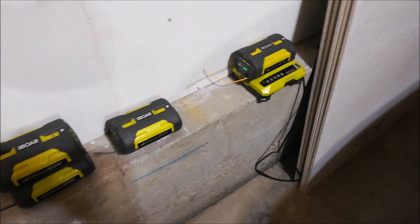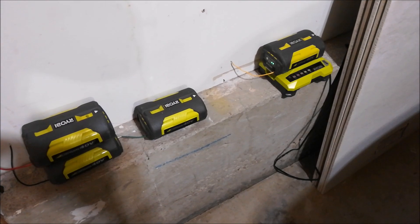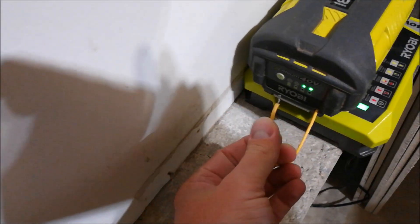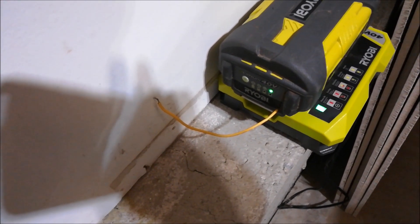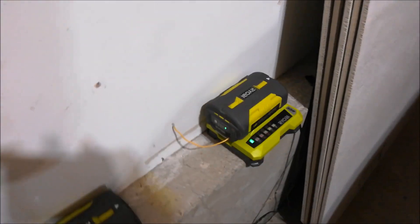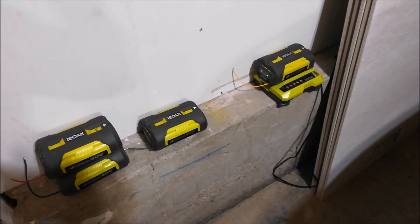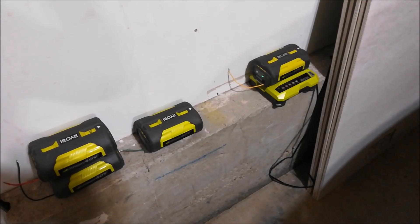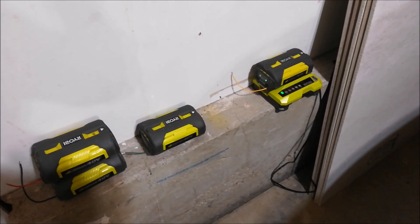It looks like if you're looking to fix one of your Ryobi 40 volt batteries — the older ones — it's a simple fix as what you saw in this video. A little caution: I did leave these wires hanging out, and this is basically a negative terminal on the battery. You want to cap that off so you don't have any short circuits — I'll probably trim them down and cap them off. Also, because the batteries were drained down pretty low for a long period of time, they might not have as much capacity as before — I still need to do some testing on that.